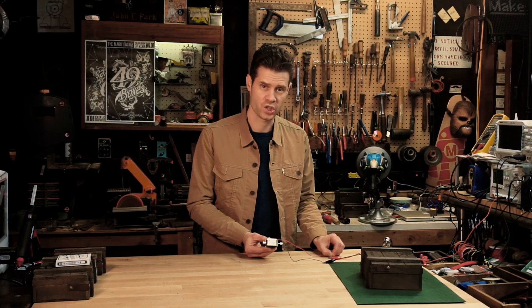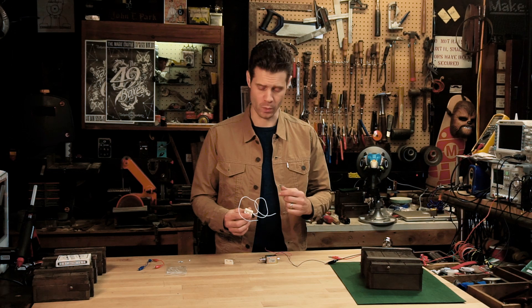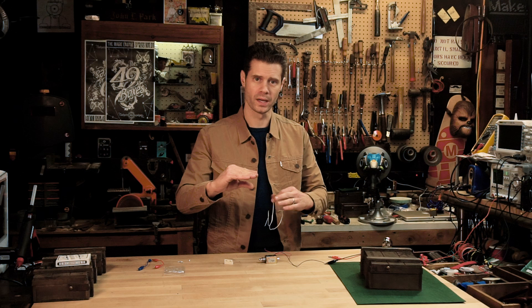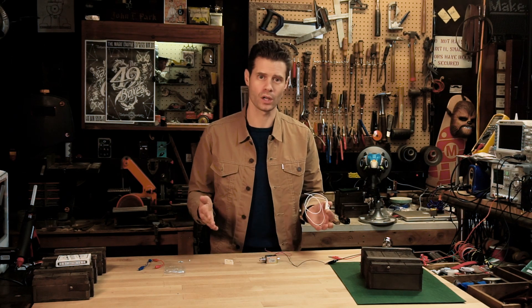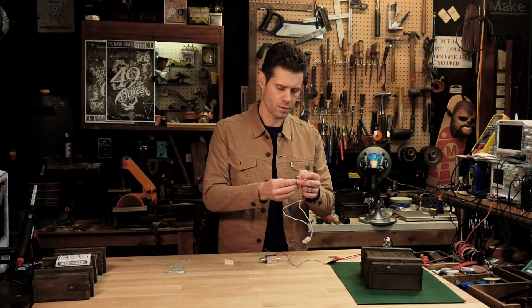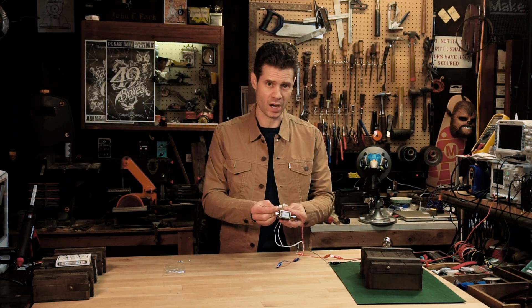When I connect the wires, the shaft pulls back — and this is how we'll create the locking mechanism for the mystery box. We'll use a special kind of switch called a reed switch. Inside there's a set of metal contacts that are normally open; when a magnet travels near enough, they close, completing the circuit. We'll place the reed switch between the power supply and the solenoid, so when a magnet gets nearby, the box will open.